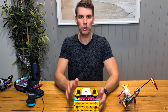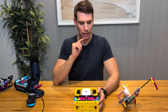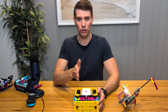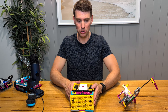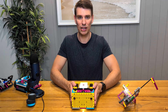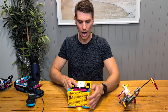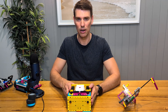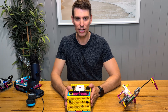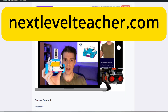Now let's move on to coding. If you want true accuracy, you need to ditch the pink motor blocks. My teams primarily rely on the gyro sensor and a proportional controller to go with it, meaning the robot drives straight using the gyro sensor. So if we set it to zero degrees, it travels at exactly zero degrees. And if something bumps the robot — say it runs over something on the table — the gyro sensor auto-corrects it back to its zero-degree heading. This is really useful for accuracy. If you want to know more about the coding and some advanced techniques to really give your team the edge, that's what I talk about in my online course. You can head to the link to join up.